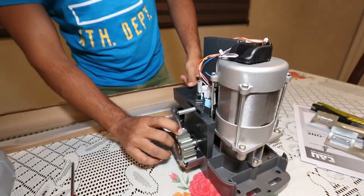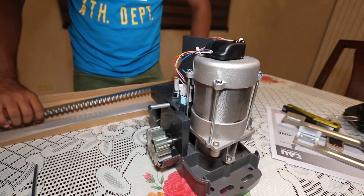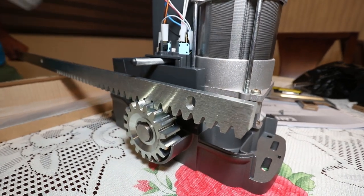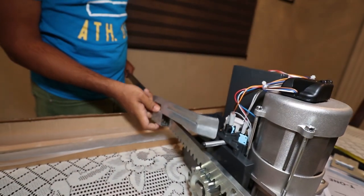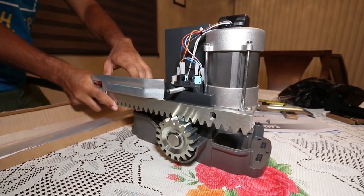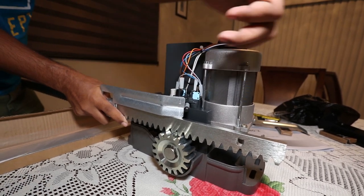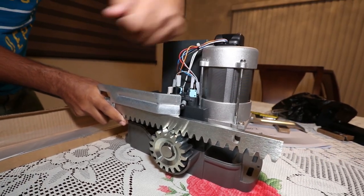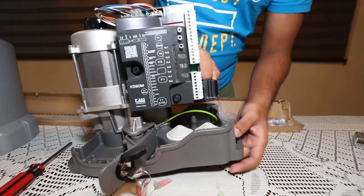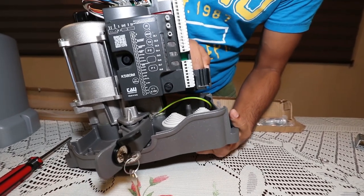This here is your gate stop. When this is connected to your track, you have your gate stops connected so that when your motor is rolling and comes along the track, it slides and then this pushes here and it automatically stops. On the other side you'll have another one — when the gate comes in the next direction it hits again and stops.